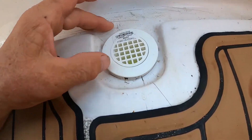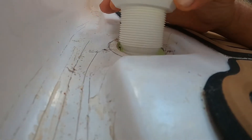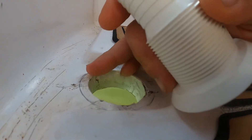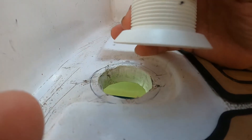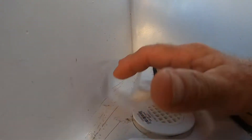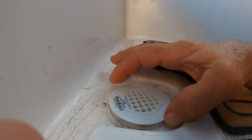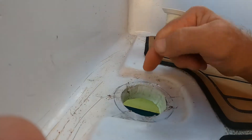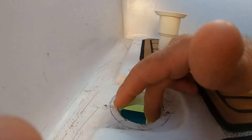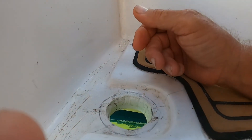I have also purchased actual cockpit drains that are tapered to fit in the hole, but as you can see on the side they sit up a quarter inch. What I've got to do is bevel the fiberglass sole so that this would drop in, then I can 5200 it in and it'll be flush with the bottom of the drain and allow the water to go out. We've been fighting that problem since we've had the boat — we didn't know water was getting between the two layers of fiberglass, between the sole and the hole.